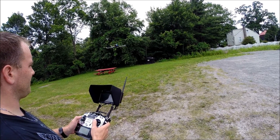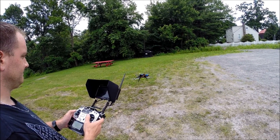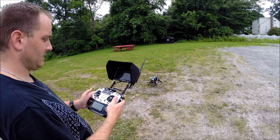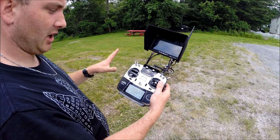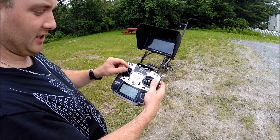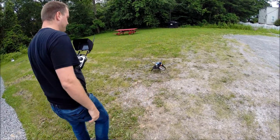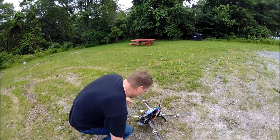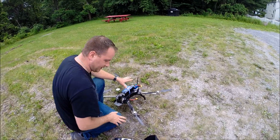We'll bring it in and I'll show you the turn-off procedure. Just drop the throttle all the way — once it's below 10 percent for three seconds it automatically shuts off and it's disarmed; it's not going to go anywhere or power up on you. The first thing we want to do is unplug the quad first, and now it's safe to be around.